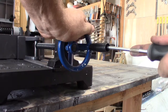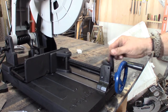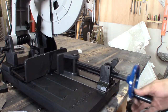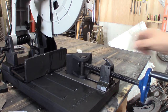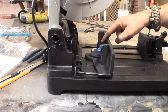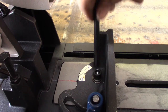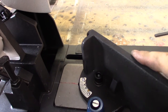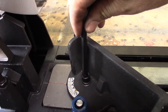A small handle attachment goes on the wheel. Now let's take a look at some of the features. What's really nice is you have this quick release section here for your clamp, so when you have a large piece you can slide it back, flip it over, and engage the all-thread clamp. To adjust your backstop, simply release the quick stop, remove your allen key, place it in the hex nut provided, and then you can line up the degree and angle that you prefer to cut.